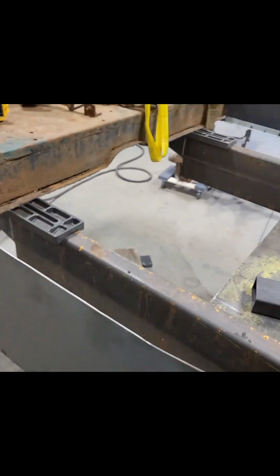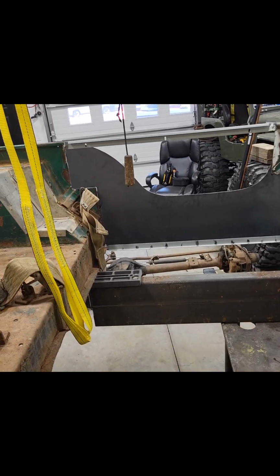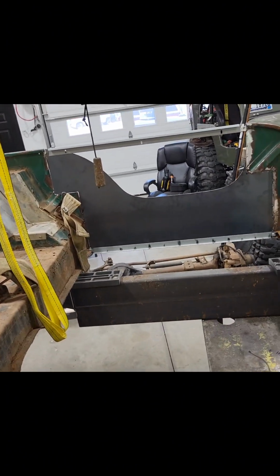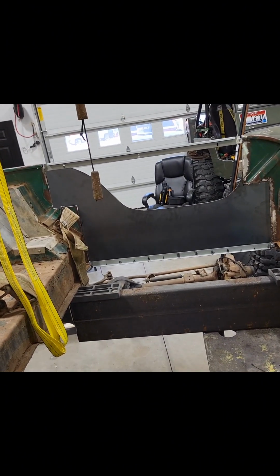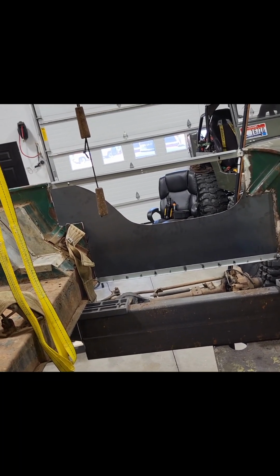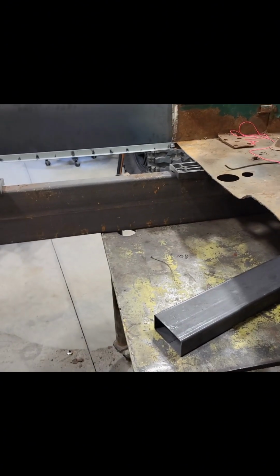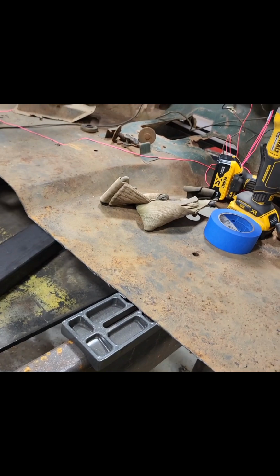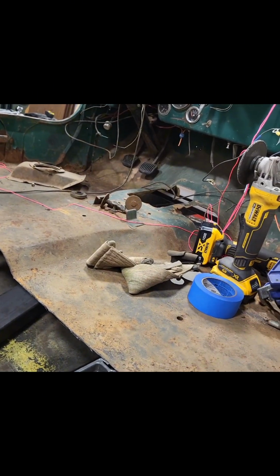There'll be a fuel tank that goes all the way across underneath this back seat. So I gotta make the floor strong enough to withstand that. I'll probably put 2 runs clear across underneath and then a little bit of webbing out just to tie everything together. And then just 16 gauge steel, plate this in flat on the bottom, and then I'll have to do some new floor pans up there.